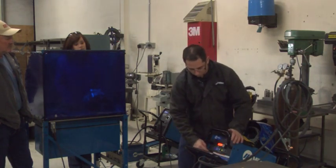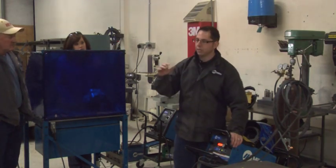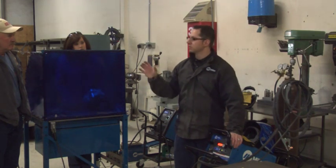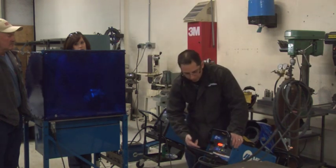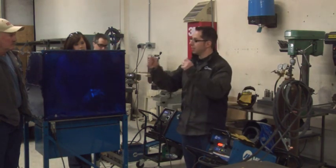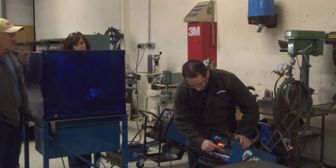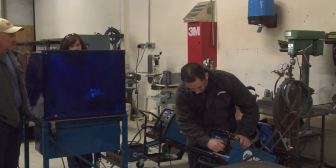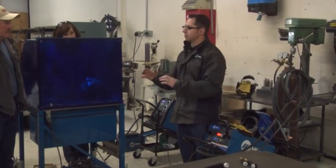Once you've got your machine set up for welding on aluminum, take a look at the chart down below. Your material thickness is set up based on the normal thickness readings for that type of material. For example, aluminum is always in decimals — 090, 063 — it doesn't give you fractional equivalents. We've set it up that way so you don't have to do conversions. If I'm setting up for 063, I run across the gray band on the machine — it's at 75 amps — just drop it down to 75 and you're good to go. It's already set your polarity and amperage; now it just comes down to technique.